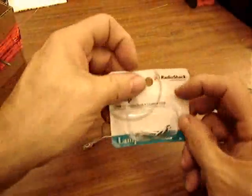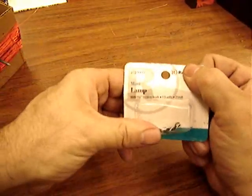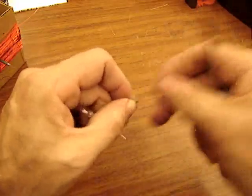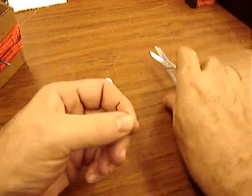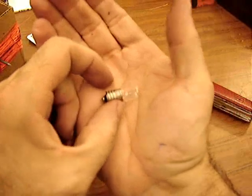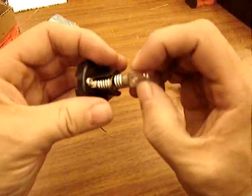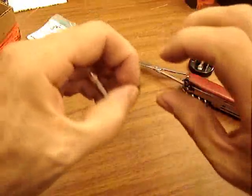Tiny light bulb from Radio Shack, part number 272-1139. Can't use normal light bulbs on this — this is a 1.5 volt, 25 milliamp bulb. You can also use, from mail order, a number 48 or 49 bulb; they're the same bulb, just different bases. This is a 48 with a screw base. You'll have to crank your generator much harder to get this one to light. The Radio Shack bulb is better — it's more sensitive.